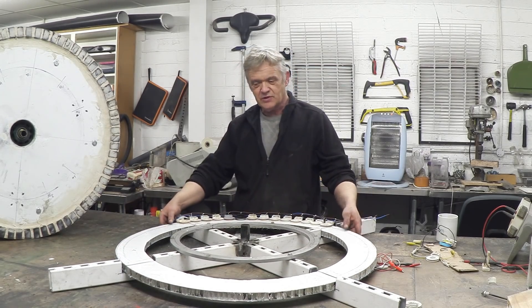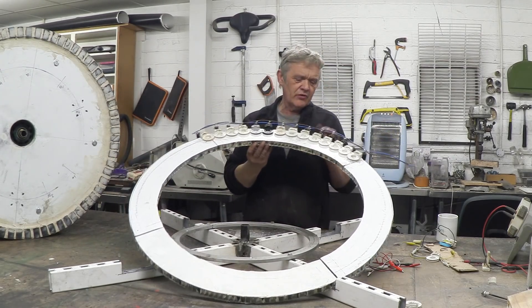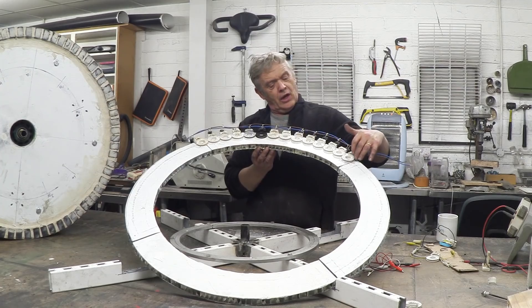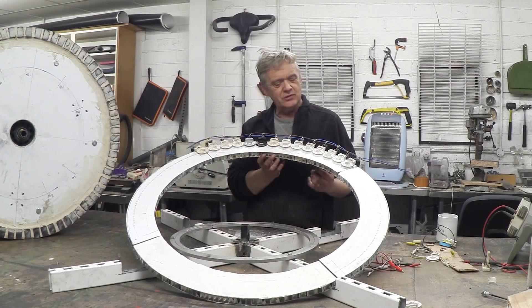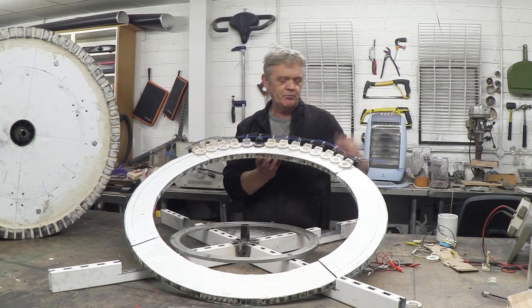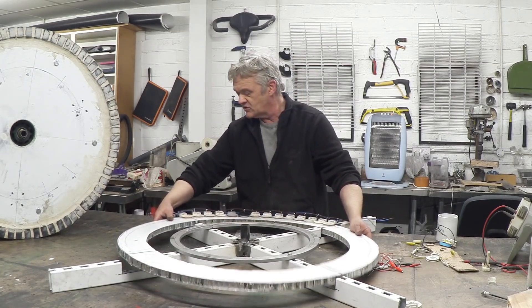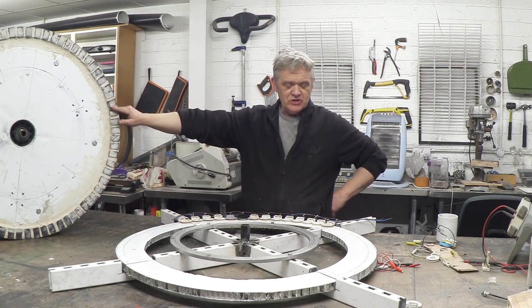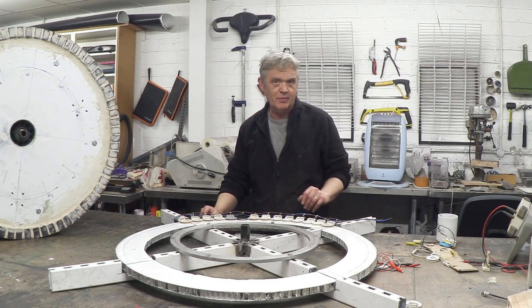What I did with that flat base is cut a second ring, which isn't actually fixed down yet. On this second ring are the ones that carry the coils. These coils are from our turntable motors — I could wind the coils if I want, but there are a lot of coils and it's quite a pain, and I wanted to collect all the scrap. No particular spacing has been worried about in placing those coils on this external ring, so each coil really must operate independently.